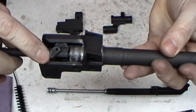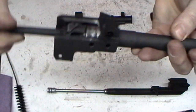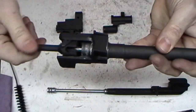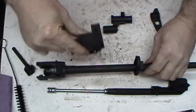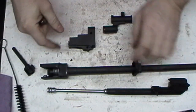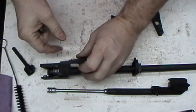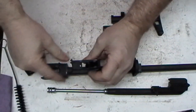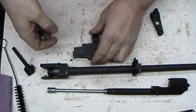As you can see, with the no-go, we don't go into lockup. So we're good. This will get us where we need to be to put everything else on, because the only thing we're going to be pressing on is the barrel. We won't be pressing on this right here for the rest of the parts. We'll put a piece in here so you don't have to worry about moving it. That doesn't mean not to check it from time to time. Yes, definitely do that.